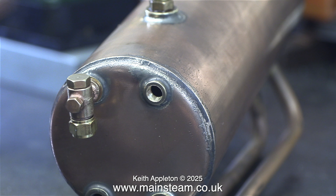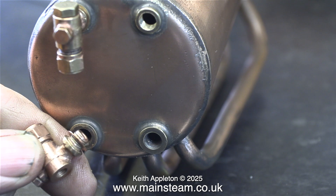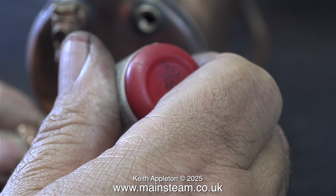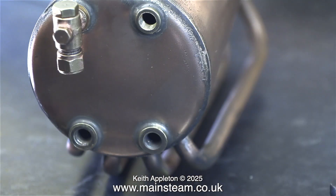So there is a bit of tolerance, because the glass tubing is not tight in the water gauge nuts. Once I've assembled all three boilers I'm going to give them a hydraulic test, so I'll look at little things like this later. I found a really good shim washer for the lower water gauge fitting, and here it's been screwed in place using Loctite 542.